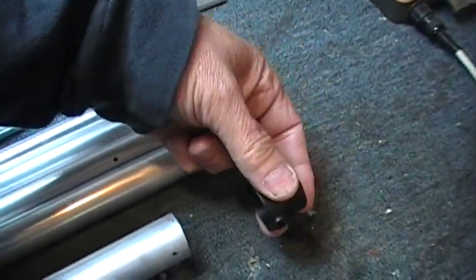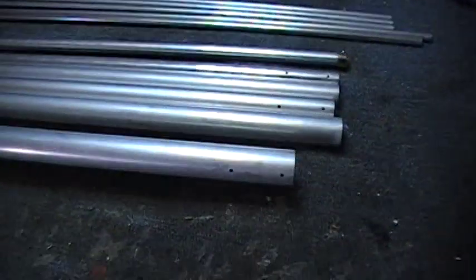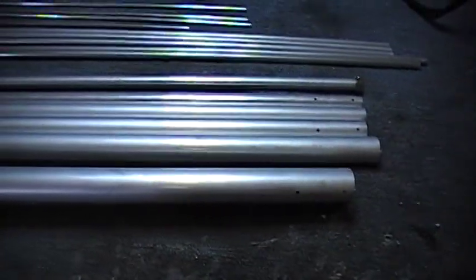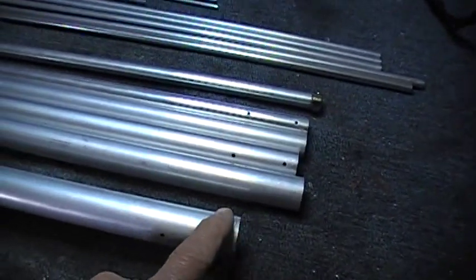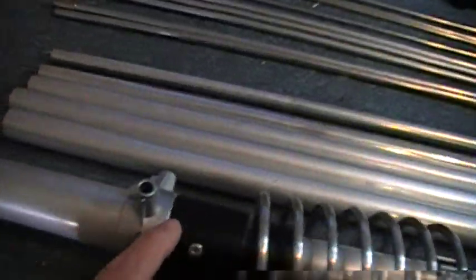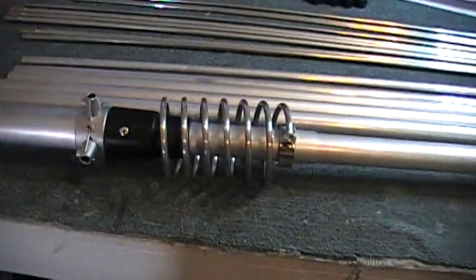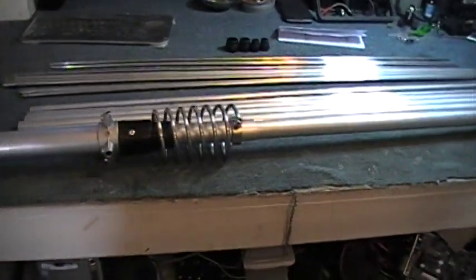And then while this is on the pole, I slid it down into place and locked it down. Now, like I said, they do compensate for water. So even if you don't do that, if a little water over time or humidity seeps in here, it will run down the center and it will drip out through the center of the antenna. So it's not like you're going to be having to deal with something frozen and broken.